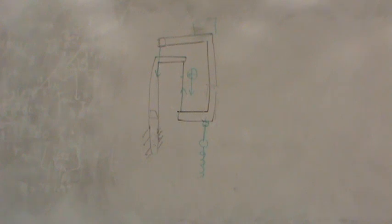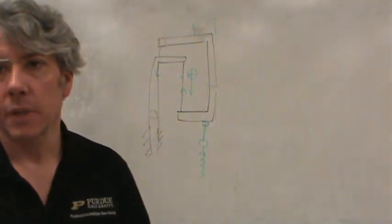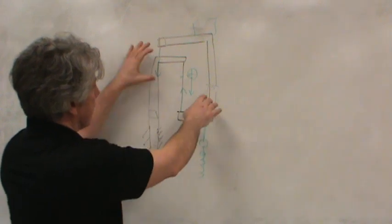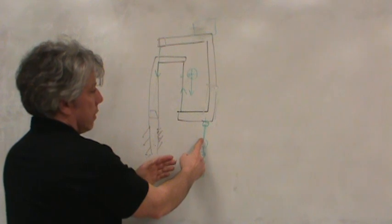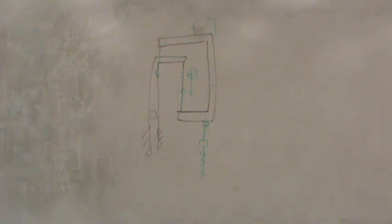The cable is connected to the ground; the weight was on the actual body. A student asks: don't both just provide downward force? Isn't the weight a fixed force and the screw a variable force? Exactly - the screw applies what's called a reaction force. That reaction force is a reaction to whatever other forces are acting. There's a minimum force just because of tension in the cables, but the cable mainly provides the stabilizing force.